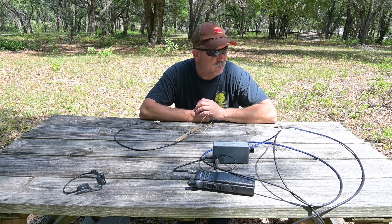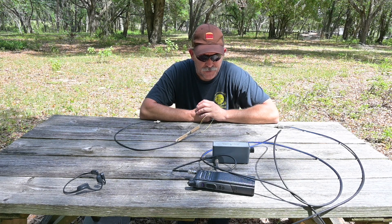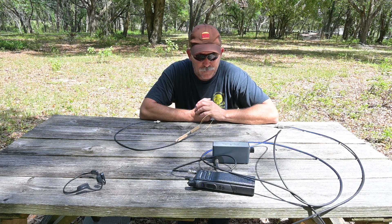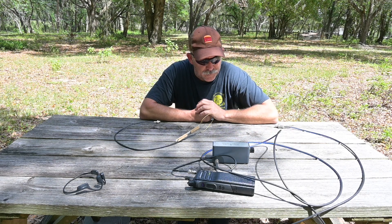We kind of see that in cases where you don't get front-to-back in a Yagi because it's receiving so much signal — an external attenuator addresses that. My spectrum analyzer has an internal attenuator accessible through a menu, but I'm old and I prefer a switch on my equipment to going through menus.